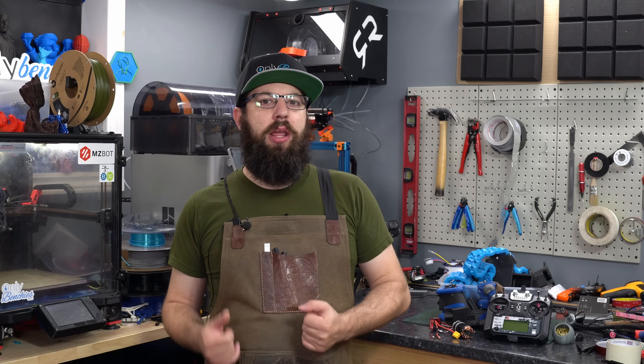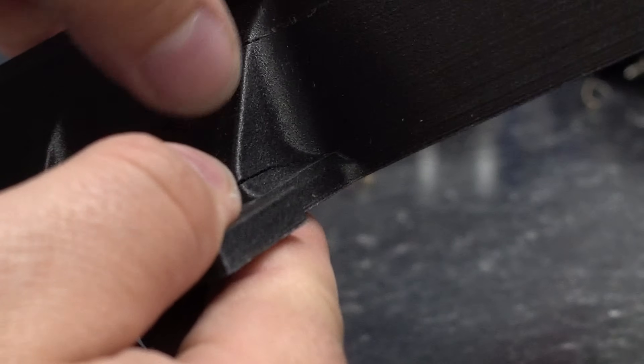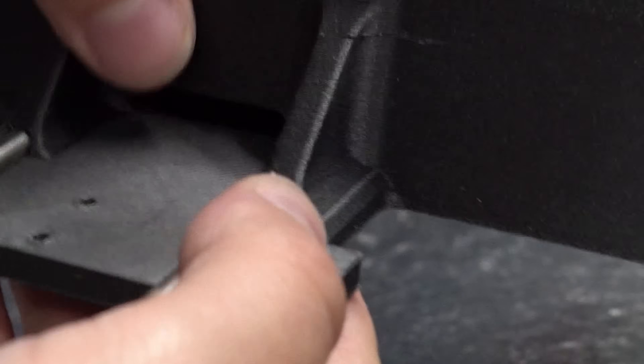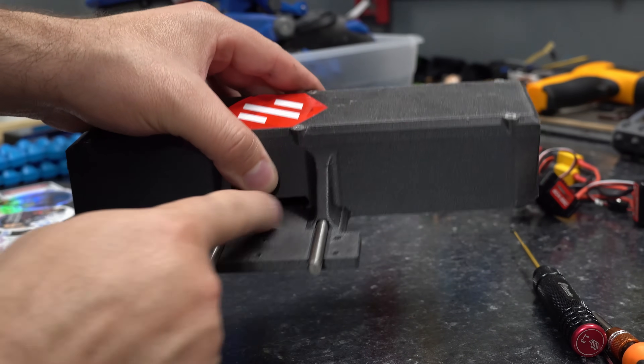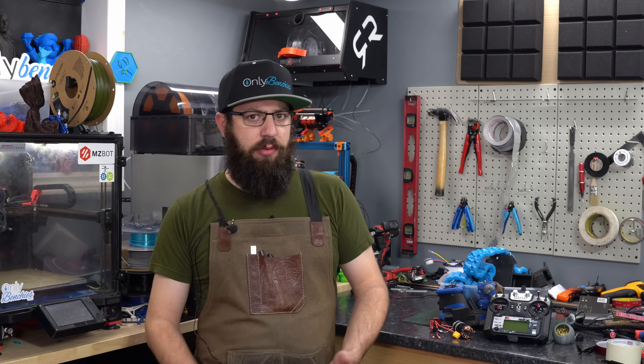For the chassis itself, the main drive body was printed out of CFPETG. It had six millimeter steel rods going through it for reinforcement. While there was a crack there, I didn't even realize it was there until the teardown itself. So it appears it held up pretty good — even though there was some damage, it didn't really affect the performance at all.